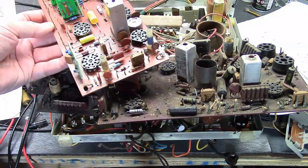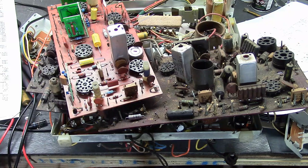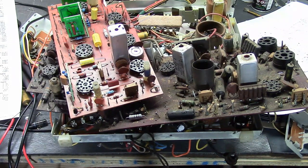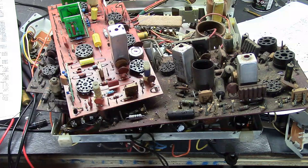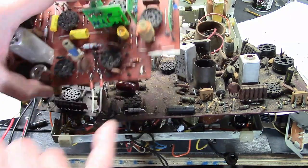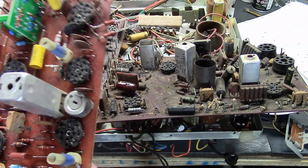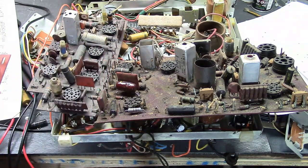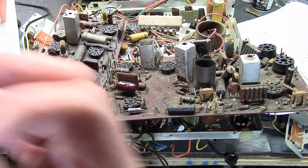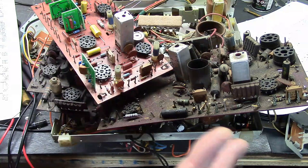Wattage-wise, I like to double it — that's what I meant by meeting or exceeding the specs. You can always go higher in wattage; that will not affect anything except the resistor will run cooler, and heat is never good for electronics, be it vintage or modern. Larger means more surface area to dissipate heat so the parts run cooler. Honestly, that PR series — I don't think they make half watt — so these little guys are actually one watt resistors but they're physically smaller than the original half watt resistors. These are two watt, and three watt is about twice that size. So all the half watts I replace with one watt, all the one watt I replace with two watt, all the two watt I replace with three watt. Because they're smaller, there's no issue whatsoever with fitting them on the board.